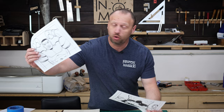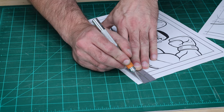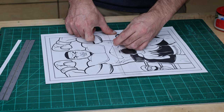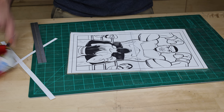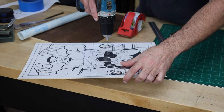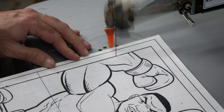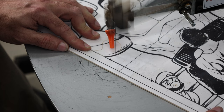It took two sheets of paper to print out my template, so I need to tape these together to make one large template. Then I'll use some spray adhesive and some contact paper to stick it onto the maple. Cutting out the silhouette for this scroll saw project is probably one of the most difficult things for me because I've got to switch my brain around — I'm not cutting out Mike Tyson, I'm cutting out the background. So that means I'm allowed to cut through his arm or through his face or through his leg, and naturally I just don't want to do that. I'm trying to stay just on the outside of my black lines when cutting, which is going to make for all those shadow lines. When I cut the pieces, you're going to have a little space in between each one, and in the background that's going to give it a really cool illusion of shadow.